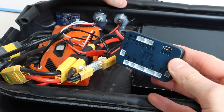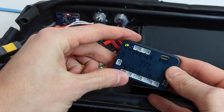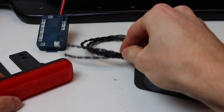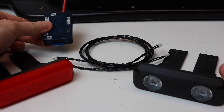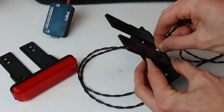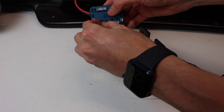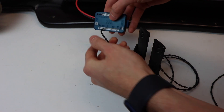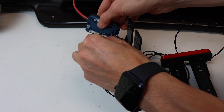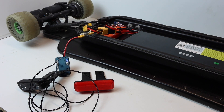The Universal Power Switch is now fully wired up — power on your board and the TTL module should also turn on. Next, connect the headlights and taillights to the TTL module using the extra-long two-pin JST cables. Connect the headlight to the H port and the tail light to the T port on the TTL module. To verify everything's working, power your board on and both lights should turn on.